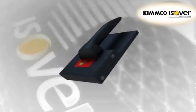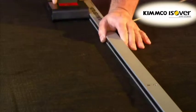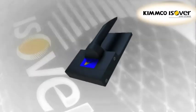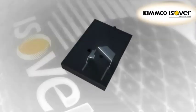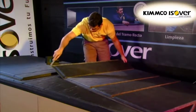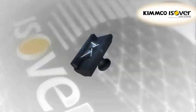The red label tool makes longitudinal grooves on the board with a modified chair-shaped profile, allowing the duct boards to be folded at an angle of 90 degrees. The blue label tool is used to make longitudinal grooves on the board, leaving a flap for the final joint of the duct. The black label tool makes shiplap edges to enable the union of single pieces or assemblies.